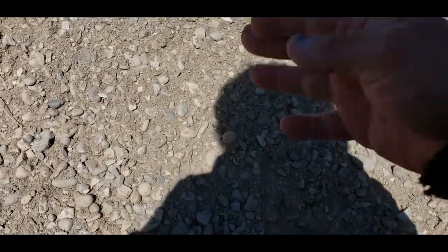The gravel you saw in my subdivision video, it's perfectly fine gravel for building on, but you've got to have water in it and you've got to process it with a grader. And those guys were pushing it around with a backhoe, and you can't do that. If you don't have the rolling action of the blade and water in it, it doesn't stay mixed up. And then if you're blading to a grade as you go, your big ones fall in and get cut off and buried. If you're using a bucket, what happens is your fines will fall out, even if you have water in it, and you end up with cobbles, rock pockets. And so you've got to use a motor grader.